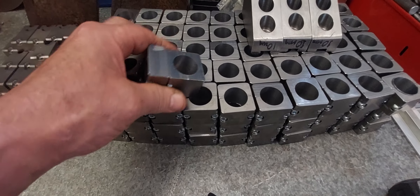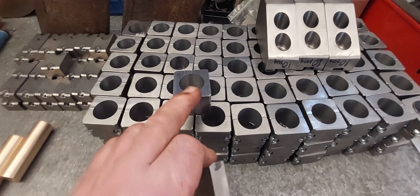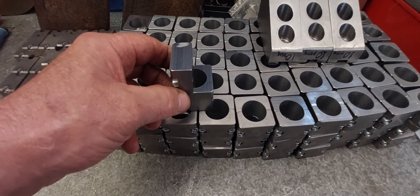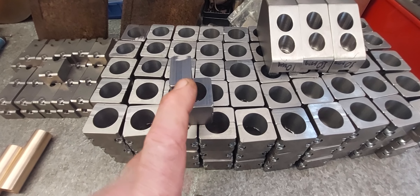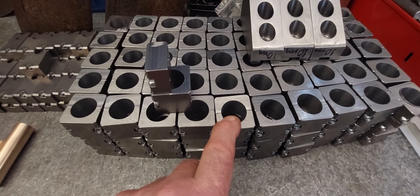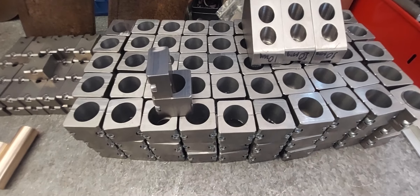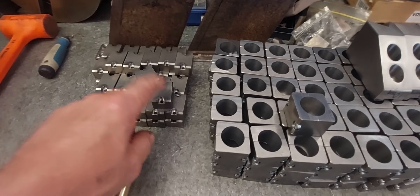So that's the top clamp there. We finish up with a scenario where you have two parts clamping together — bore out the ID and mill the OD. I'll run you through a little bit of that without making the video too long. It's the first edited video I've ever done, so we'll see how that comes out. I don't have enough bottom clamps — I've run enough for the top clamps. I normally make about 200 of these parts at a time: a hundred lower and a hundred upper. They have another machine part on the side, which will make more sense in the next video.